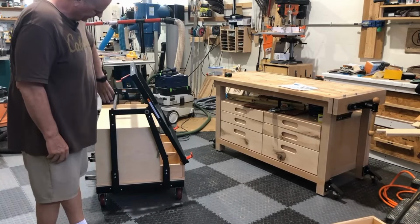So I had to raise it 2 notches higher. Now, without the top, it's 35 and the top is 1 1/8. So it's going to be just a little over 36. I guess not too bad. If I find that to be a problem in the future, I'll lower it by 1 and cut a notch here. But let's see if this will work. So now there's no issue. Like as I said before, the plans don't have much detail, but this will work.